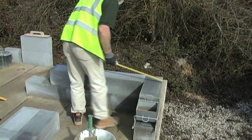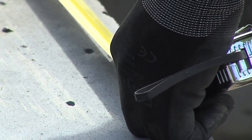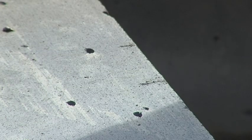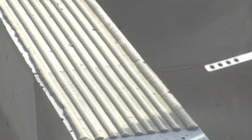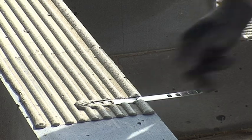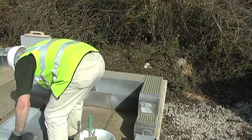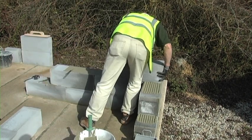There is an internal partition wall coming off the solid wall and I'm just measuring up and marking where the internal wall is going to be. I'm marking the thickness of the wall on the block work because I need to insert an internal partition wall tie to tie my internal wall to. Here is the internal partition thin joint tie going into position. It's just inserted into the mortar joint and my block will be laid on top, which will tie my internal partition wall to the solid wall construction.